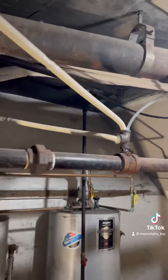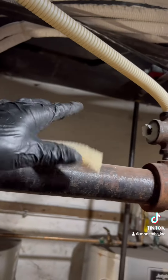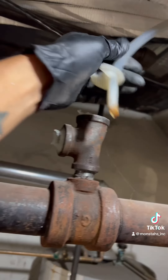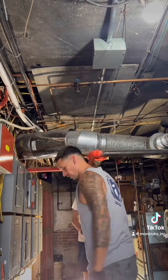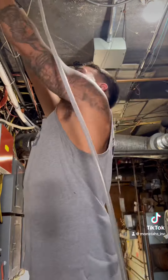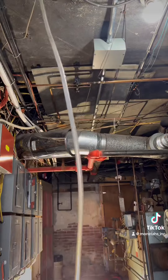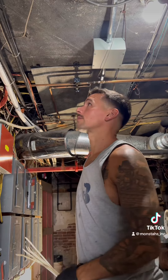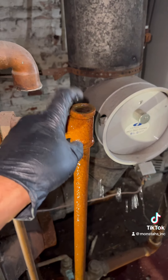She's all said and done — got her tied into the sanitary system. The brick wall and hanger are over there if anybody's curious. Now we're going to rip these lines right out of this sucker and start rerouting them in the ceiling and down to the new standpipe. Unfortunately only two of them are going to reach the standpipe — the other two across the room are too low because they're for the basement.